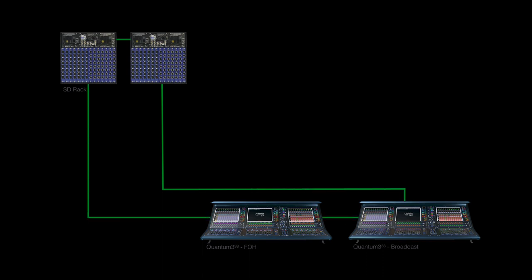All right, next we're going to connect these all up via a fiber loop or fiber ring, as we talked about before. This means we're going to take fiber between device to device to device back to the first. That'll give us a redundant loop.